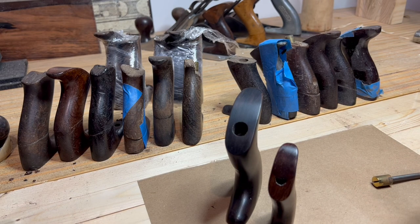So it's easier actually to drill a counterbore in a through hole in a piece of wood that has no voids in it than it is to try and restore with a drill bit and a drill press an existing counterbore that's half covered up. So you risk chip out and wobble and all kinds of fun stuff and fixturing and location.